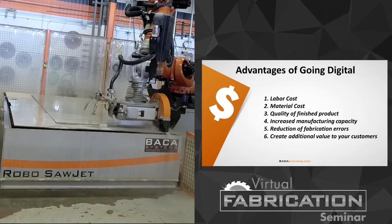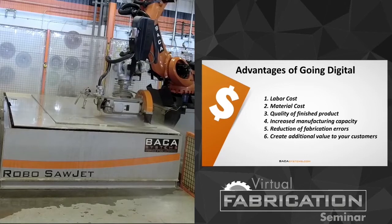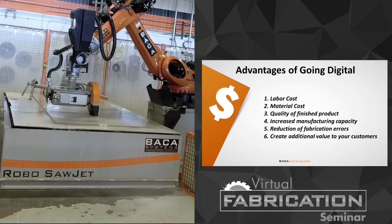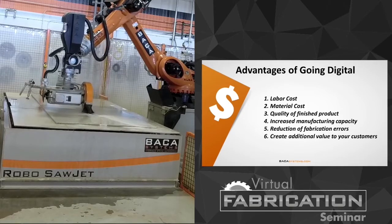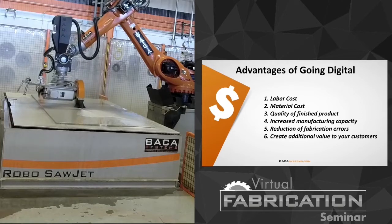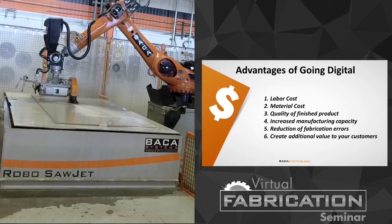So we talked originally last time in our virtual fabrication seminar about our labor costs and why you go digital, and the material costs, saving you up to 10%, 15% sometimes on the commercial jobs. You go into the quality of the finished product, being able to cut your sinks and your faucets and your radiuses and scribe back walls and make the parts fit better. Making the quality of the sink cutouts and the radiuses perfect every time is dramatically different from trying to do that by hand with your grinders, compared to doing it with the water jet and increasing the capacity all at the same time.